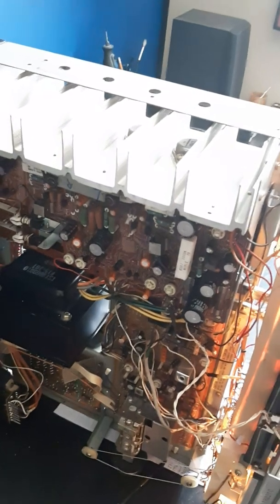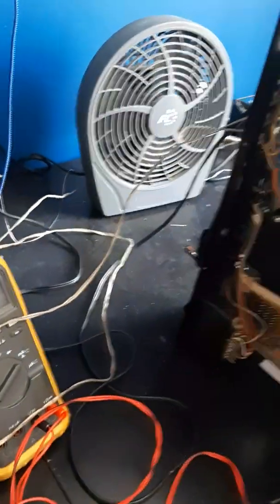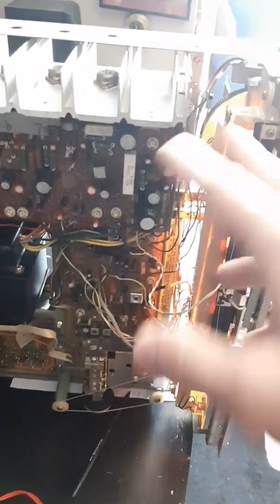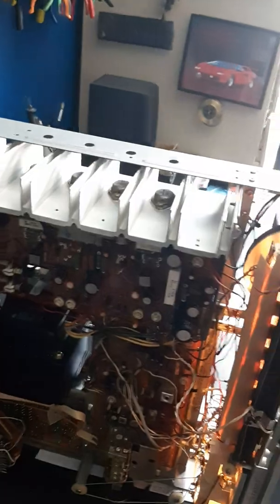The buzzing being on both the left and right side is very indicative of a power supply problem. If it were an amplifier problem, the buzz would only happen on the channel that's problematic. Although it's making that loud buzzing sound, it's not making the popping or crackling sound. I think what happened is instead of changing the right components, they just took a few guesses, changed a few random capacitors, and then adjusted things until it didn't make that horrible sound. If I turn this back down to 20 volts it'll eliminate the buzzing, but that's going to cause other issues in the amplifier.